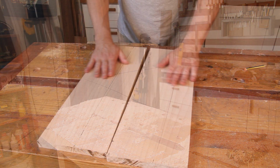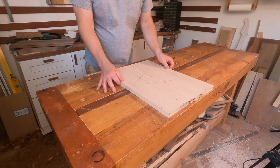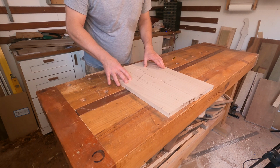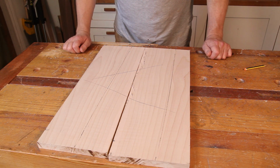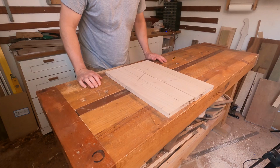And there we have the two bits of the top thickness down. They're still a little bit grungy, they'll need a little bit of hand planing. Regular viewers will probably remember me saying for at least the last 3 builds that I need to put some new blades in that thicknesser, so it isn't doing the best job at the moment, but it's got them to kind of within the point of cleaning up with a hand plane and a card scraper, so I'm more than happy with that.